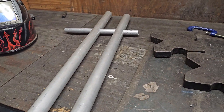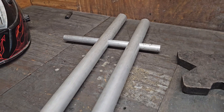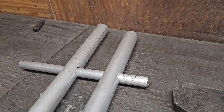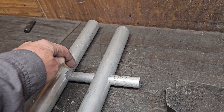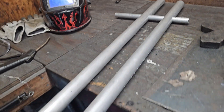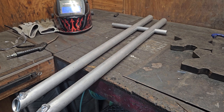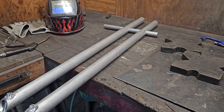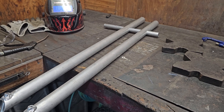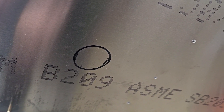Since I didn't have a 7/8 drill bit I just hogged it out a little bit with the burr — she's straight and in line. The next thing I need to do is cut the legs off, still leaving a little extra to make welding easier, then fit the whole assembly into the airframe — both pieces. I've seen somewhere, either in the plans or elsewhere, that they recommend using a piece of pipe going from side to side to fit into the axles to make sure everything is straight and lined up.